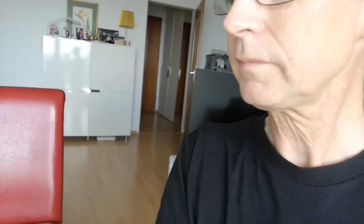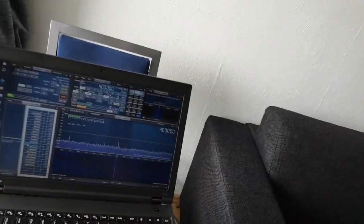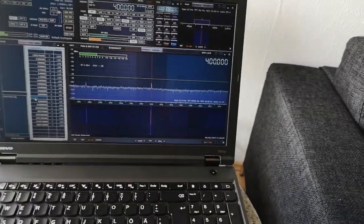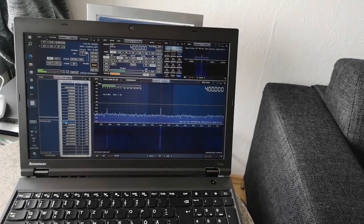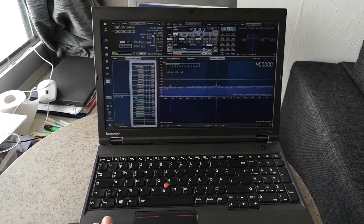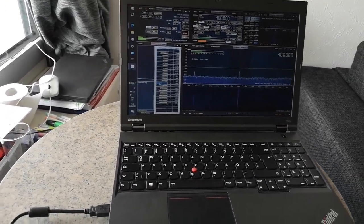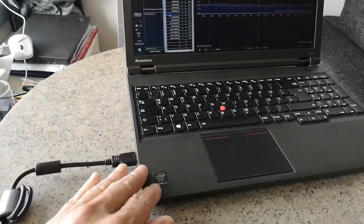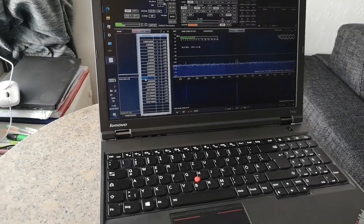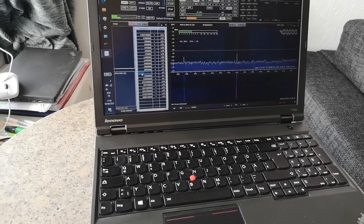I've also been playing with noise, as I did in earlier videos, using RF chokes on cables and addressing USB noise from laptops. I had to choose the laptop with the lowest noise, which happens to be the Lenovo T540P from my Lenovo graveyard — an i5 Series 4, quite long in the tooth, but it seems to be the best-shielded laptop. It's extremely heavy at over two kilos, but it has a very solid magnesium or aluminium alloy frame, and it really produces quite low noise.